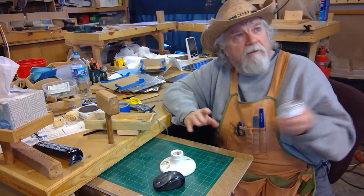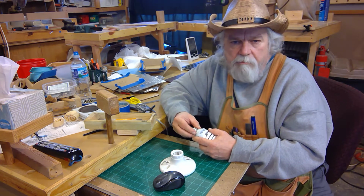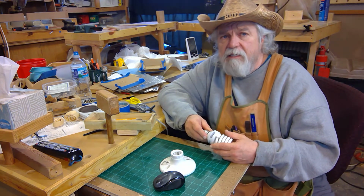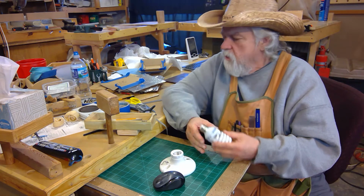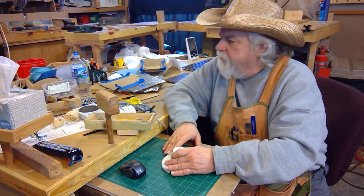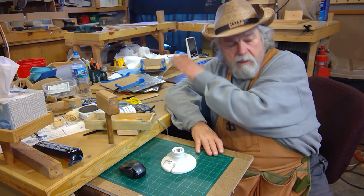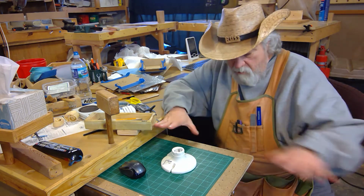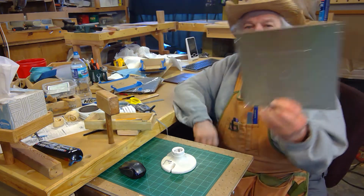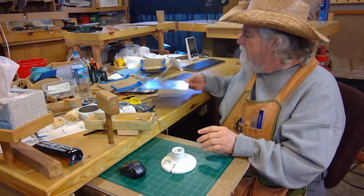Now, I got to thinking about it. Somebody mentioned to me that the 4-footers had those deflectors on them to help reflect the light downward. I got to thinking about that, so I decided I could do that for these too. I made a couple different ones trying to make prototypes. What I basically did is take a sheet of cardboard, spray adhesive on it, and lay tinfoil down to make a sheet of cardboard with tinfoil. And then I cut it into 8x8 sections, tinfoil on one side.